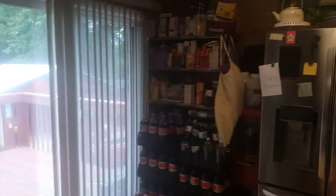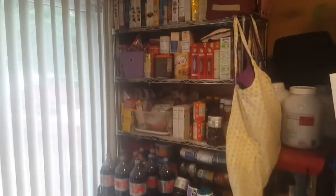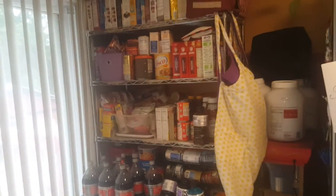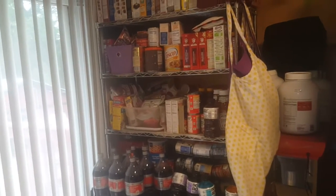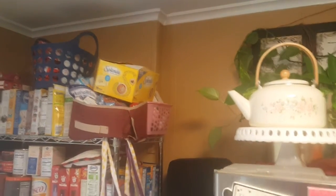Last thing to talk about is this side of the room. What we have in the drawing is 33 inches of wall, there's actually 33 and a half. The room behind the door trim is 14 and a half inches. So I was suggesting to the customer that we actually do a UT 30 14. We do the reduced depth on it to 14 from 24 and add a 3.5 inch filler to the left of it before we do the 24 inch depth pantry to the right of it. You can see there's about a 3-inch jog in the wall there where the wall jogs back in place, and then the wall comes across to this length here at 64 3/4 inches.